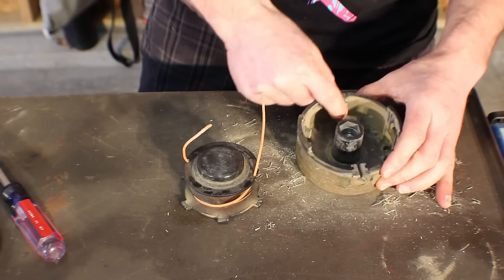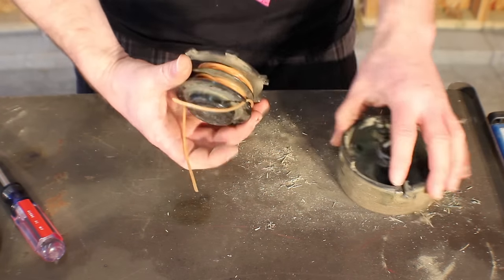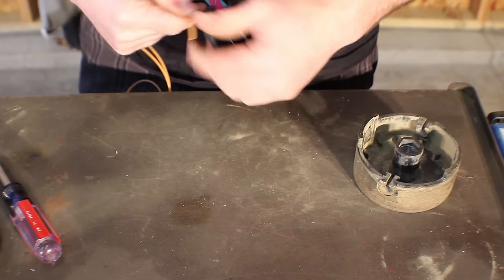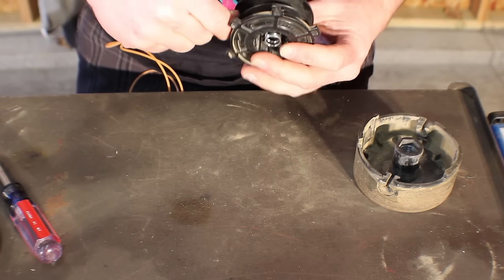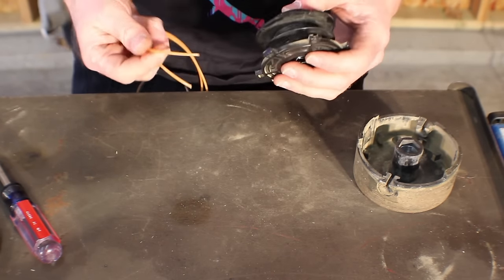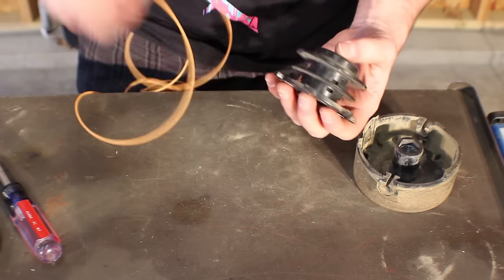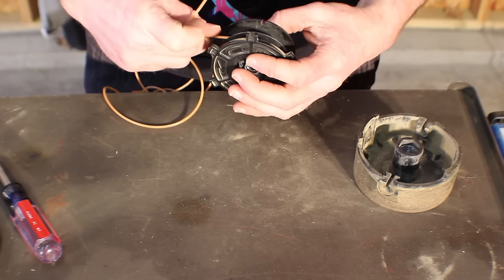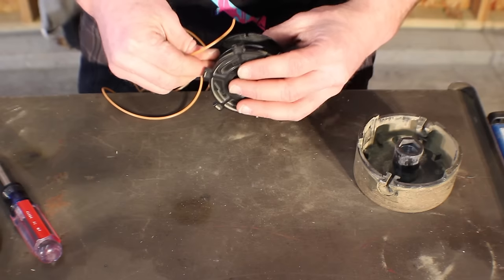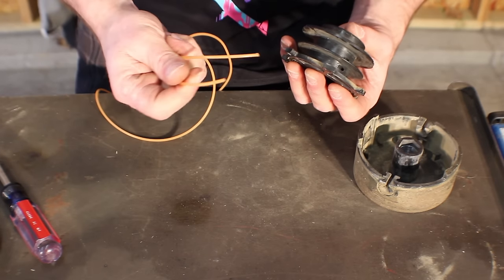When you're doing this you don't want to lose these metal pieces — these eyelets can't get lost. I'm going to go ahead and unthread this. I'm not going to do this completely by the book. The book will show you to stick a line in on one side and then stick a line in on the other side — that's not the way I do it, I find that to be kind of a pain. So I'm going to demonstrate the way I line my heads. I've already got my line cut. Per the book you can fit about 16 and a half feet per line, so a total of about 33 feet in here. I don't put that much in — I find it's easier to put a little bit less, so I've got mine right at about 12 and a half feet.